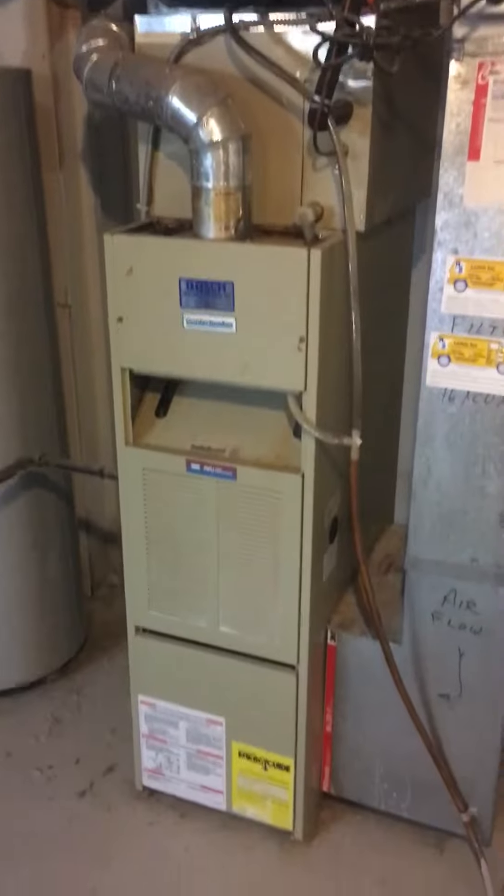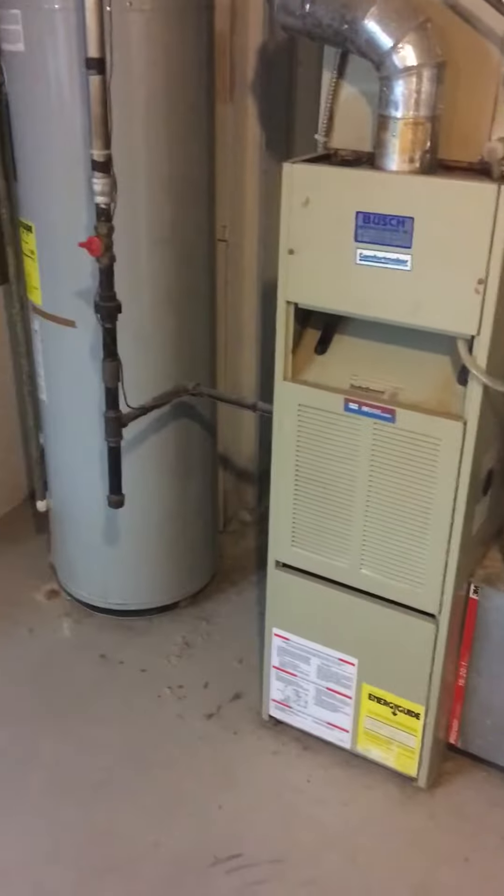Central return of the home, and then this is the front. Gas valve over there. There's a flue liner — let's get that pushed in a little bit more, screwed on and then taped. Let's get some foil tape around that, and then make sure we've got three screws in all the flue piping.